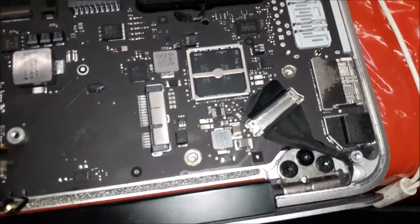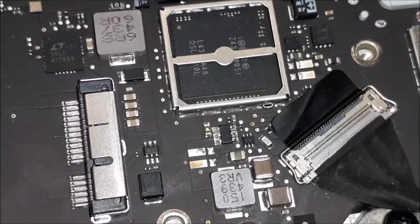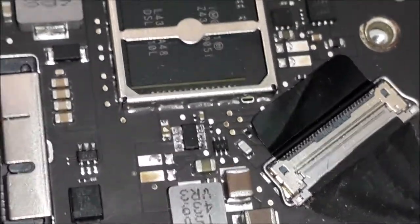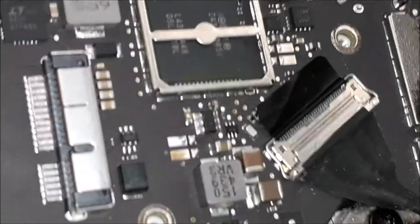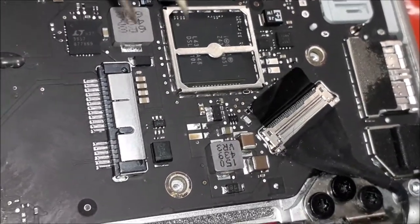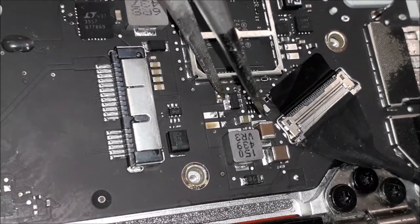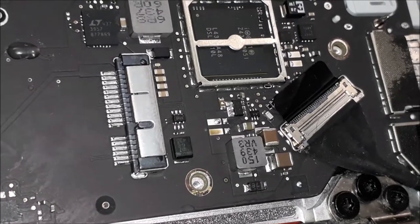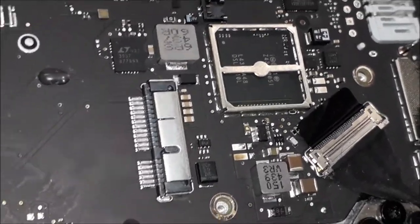So, what I found on the microscope, the component over there next to the fuse has a corrosion. Yeah, I just did the clean, but I will have to remove the component over there and redo the solder. Remove that solder, put a brand new solder over there. Let me see if my camera can focus, and you guys will be able to see the little corrosion that was there. Can you see between this pin and the other pin there, the junky corrosion over there, you know what I mean? We're gonna remove the chip anyway. But as you guys know, we will have to put this board in the ultrasonic and give a proper clean. You guys are gonna see in the video anyway.